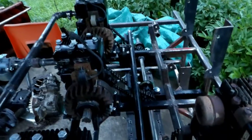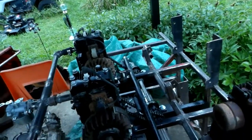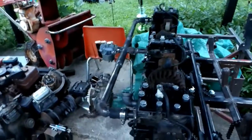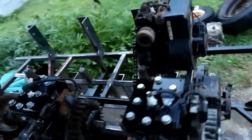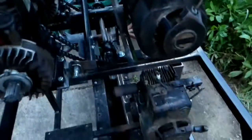The other thing I've got to do is mount a gas tank to feed the carburetors. I've got one made from a little one-pound propane tank. It'll have to stand up on a stilt or something to get it up above the level of the carburetors. This setup of three here will be duplicated down on the bottom row, and I'll have to figure something else out for the chain tensioner because the geometry will be different on the next level down.